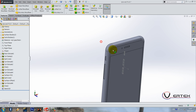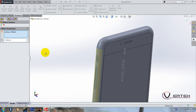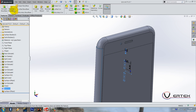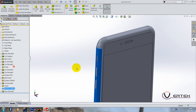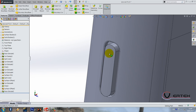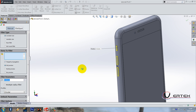We need a surface offset — select the surface and offset 1 in this direction to the left side. Sketch, draw, and do extruded boss up to the surface. Hide the surface and we've got the buttons. Apply fillet 0.1. I'll use the 2014 help for filleting — press this one and done.